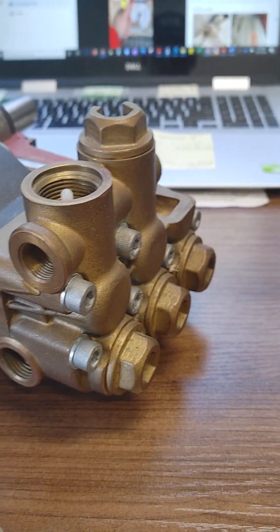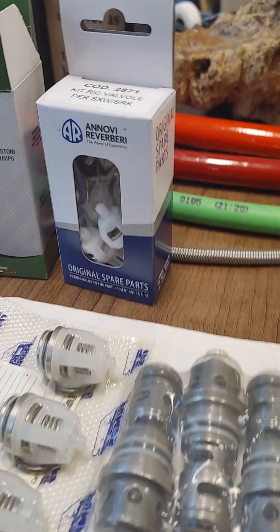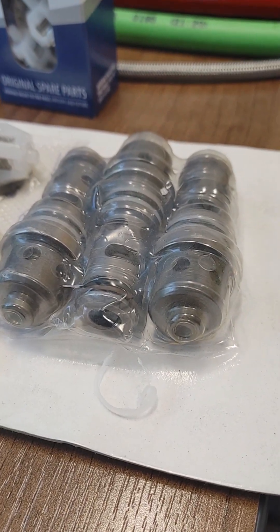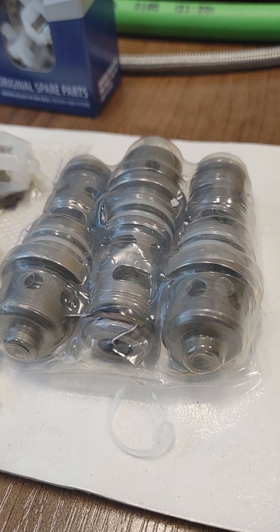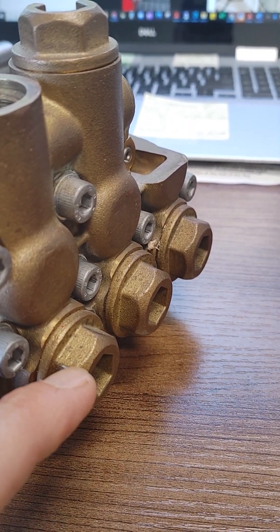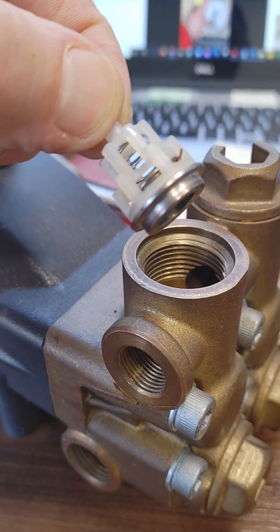Let's look at the pump. Here we've got a classic triplex water pump. These come from General Pump, Giant, Udor, and others. There's a comment here — here's one from a Cat pump. There's a stacked valve set that's a little different animal; if you have any question about stack valve sets, send me a DM. But you still basically need to just clear the valve. Here's your pump, and you have these hex plugs — they're actually called valve covers. Underneath each one of these is a check valve.